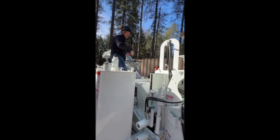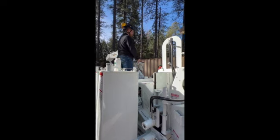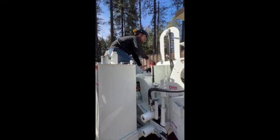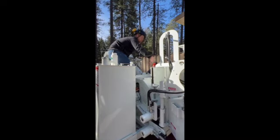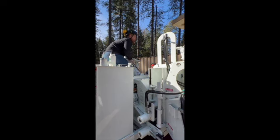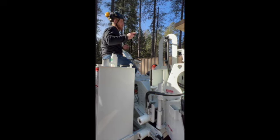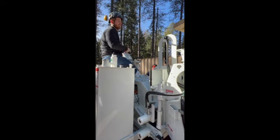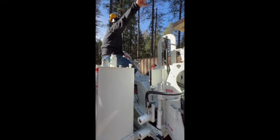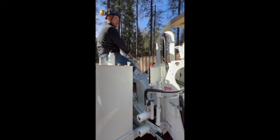Now the reason, guys, I say that rope shear device is a shiny object, if you think about it, you have 4 knives on this drum. Let's say this knife up here has the rope picked up on it and is being sheared up here. Well, your 2 knives down here already picked that rope back up. It's still going to chip the rope up. All that's doing is chipping your rope into about 2 to 3 foot sections, which prevents the drum from wrapping that rope around the shaft. Really, it's saving the machine. It's not saving your life on the end of the machine. You're still going to get sucked in. So please do not rely your life on that rope shear device.